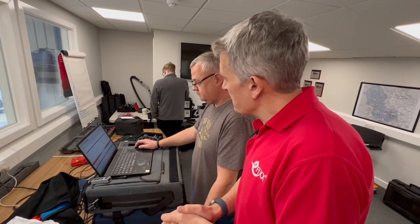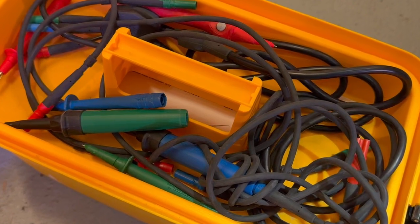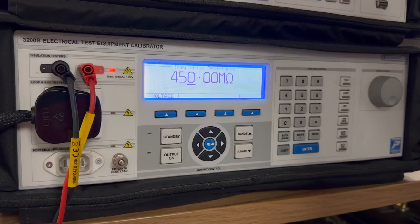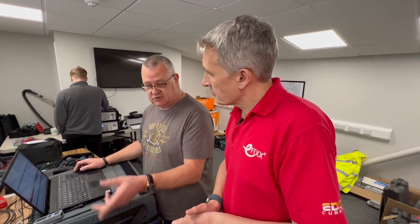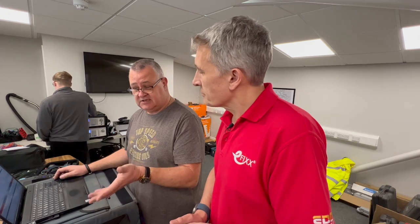What are the failures you typically see on a tester? The most common failures are poor leads because of muck, which creates a resistance that raises the result above spec and causes it to fail. They have their own leads with resistance tuned into the calibration software so the tester passes normally on those, and then they check the customer's leads - especially if the customer has a query about them. Low batteries are another issue: you'll get a false result or readings will bounce around erratically.